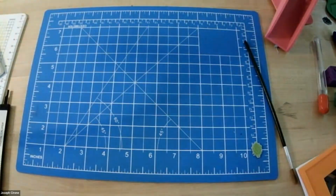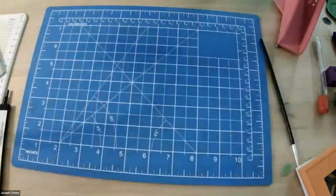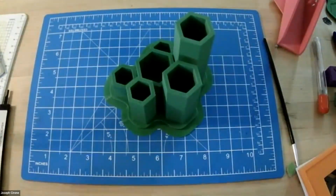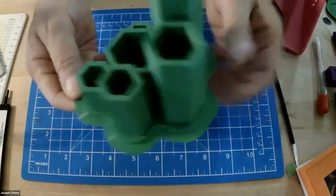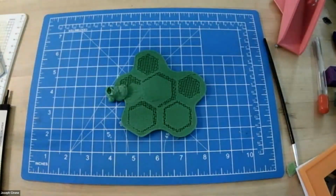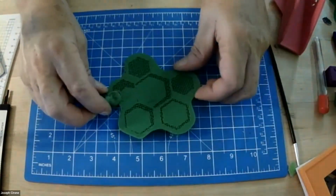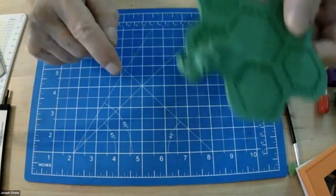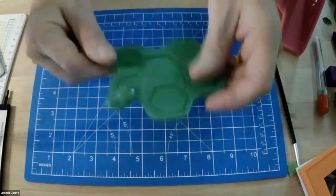We take another print, and this one's just sliding right off the build plate. I don't even need to remove it. You can see that we have used a brim on this, and that's to keep it from peeling. Here's a failed print. What happened was the part actually shifted on the plate and then came off, and then it created this big glob of printed material because the part is shifting around as it prints.